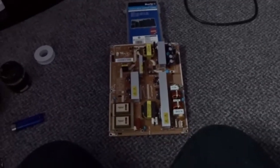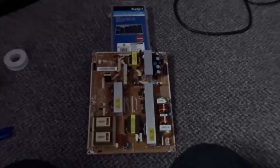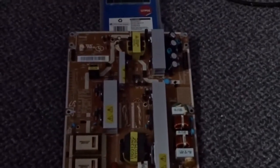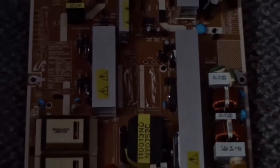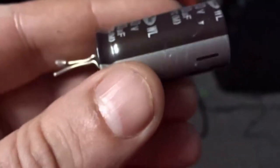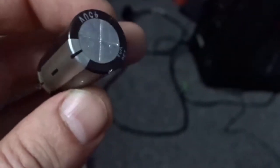I'm sorry about this video being a bit all over the place — I've been busy in my man cave decorating and putting a bed together, so I had to fit this in whenever I could. But while I'm here I might as well take those caps out — those two big filter caps in the middle. I've got them out and as you can see they're in pretty bad shape. They are quite badly burned and bulged. The other one's worse — you can see they're quite discoloured, burnt, and significantly bulged.